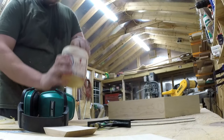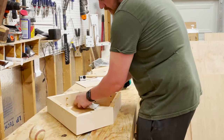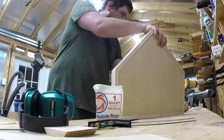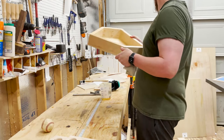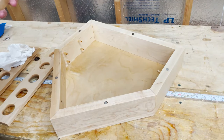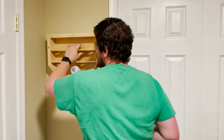After one final sand off camera, it was time to add the finish. For a finish, I used boiled linseed oil — I applied a little bit to a rag before rubbing it all over the frame and the cover, making sure to stay away from the plexiglass front. All you have to do now is load it up. And so that's how I made this baseball display case. I really hope you enjoyed this video as much as I enjoyed making it. If you did, I would really appreciate it if you would leave me a like and subscribe. Thanks so much for watching.